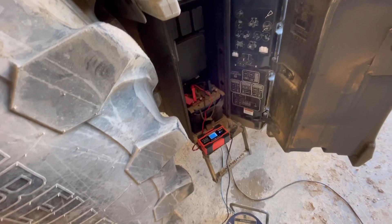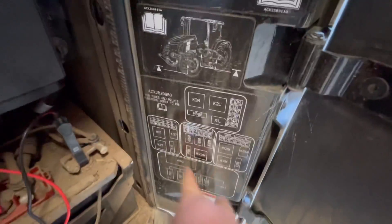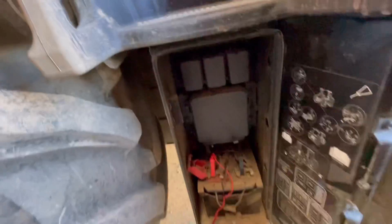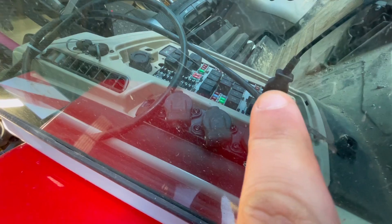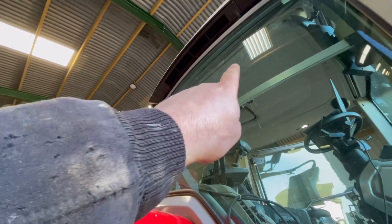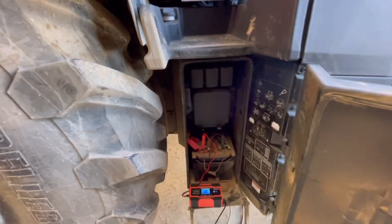This panel here - that's a little trickle charger just keeping the battery charged whilst the main dealer does the calibration with the laptop. I've got some details here because of all the fuses - these are the fuse diagrams. This here is the hydraulic filter - hydraulic oil for the tipping rams on trailers - it has a separate system to the back end, which is really good so it doesn't get contaminated. Fuses and relays are here. The next set is just there - that's obviously the laptop plugged in calibrating. More fuses up there beyond that panel, and then there's another fuse beyond the seat for the seat which not many people know about. So four fuse locations on this tractor.